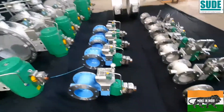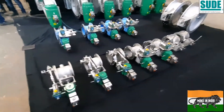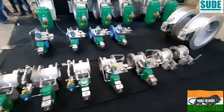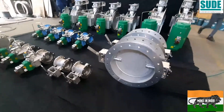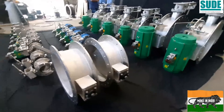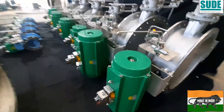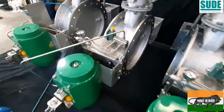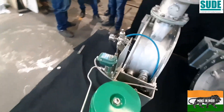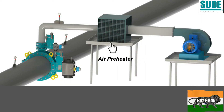The seal air barrier is created by injecting seal air in between the gap of both blades at a pressure higher than the media pressure present in the duct. As a result, we achieve 100% sealing efficiency and isolation in the gas duct. The seal air quantity and the relevant pressure required to achieve 100% sealing efficiency depends on the size of the damper valve and its operating conditions. It is calculated individually for each damper valve, and accordingly the seal air inlet damper, fan, and preheaters are sized.